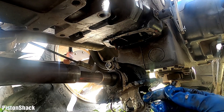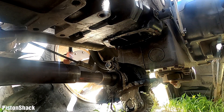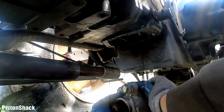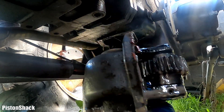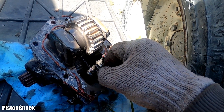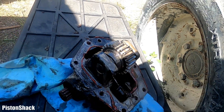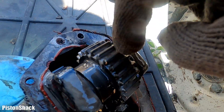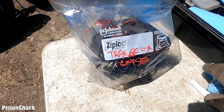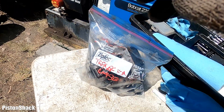I notice there's a jammed spring pull-off — there's a shifter here. Let's pull it off. This transfer case will need a good cleanup. The spring needs to be replaced — it was sitting here, as you can see it's mangled. Definitely no go. So far so good — no broken or missing teeth. The middle is just like yogurt.